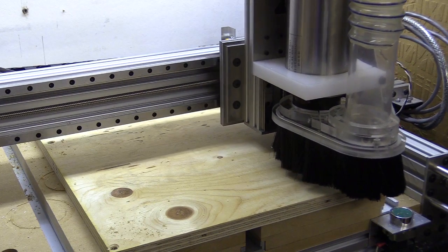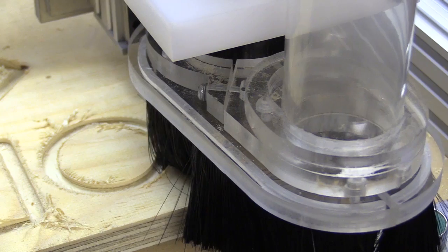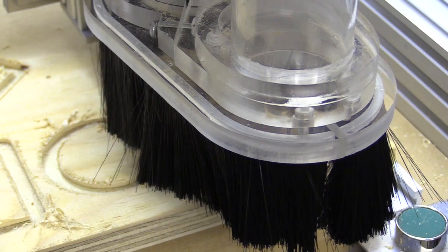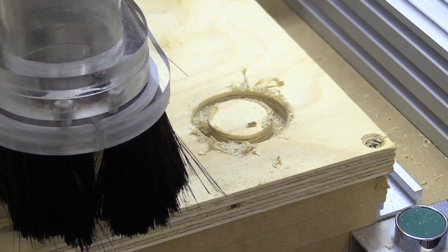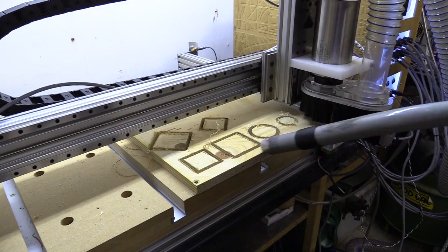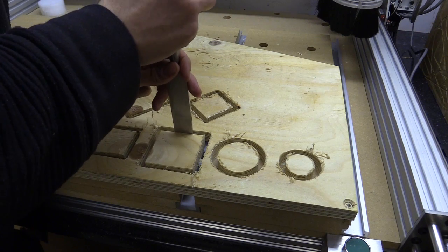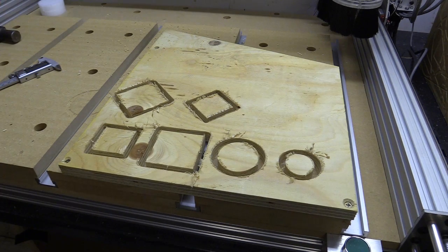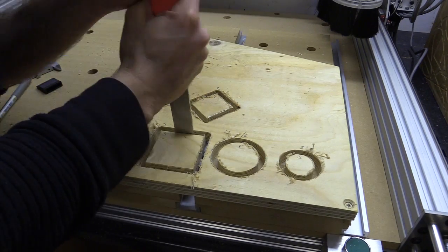I repeated the cuts using the same method — completing the cutting job at 4mm down, letting the machine return to the origin position, loading the second part as a separate file and cutting down to 18mm. That seems a lot better. The issue was the acceleration. So now I'm going to start cutting the parts out so I can measure them, marking the corners to keep track of orientation, and taking measurements using my caliper and engineer square directly from the shapes.